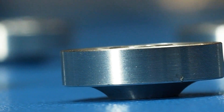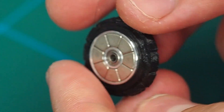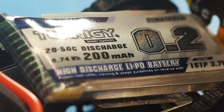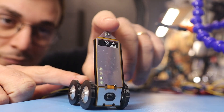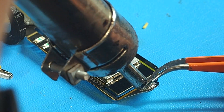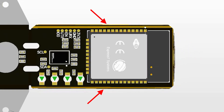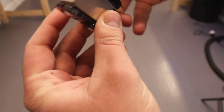The motors are made from an aluminum housing that holds an iron back plate and 8 arc magnets. The tires can be directly mounted to the rotor as they were printed with flexible TPU. To make the robot more robust I found standoffs that could be screwed directly from side to side. The plan was to use a one-cell 200mAh LiPo battery, but this wasn't fitting well with the new electrolytic capacitor, so for the first test I replaced the standoffs with nuts. I also changed the top-side locking mechanism to use a solderable nut. The new PCB also includes small extra tabs to close off the top-side gaps.